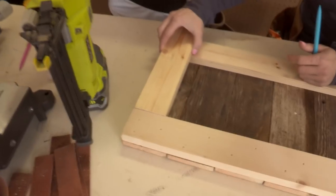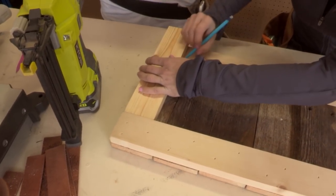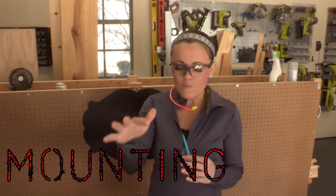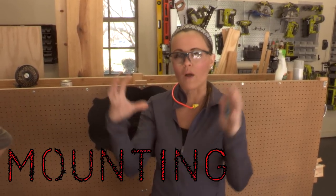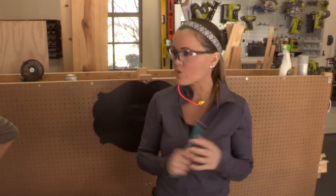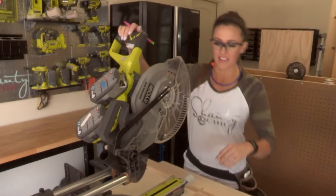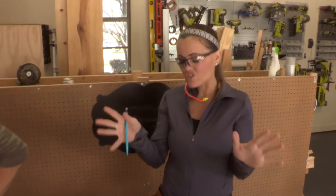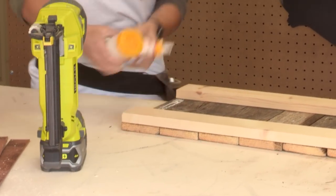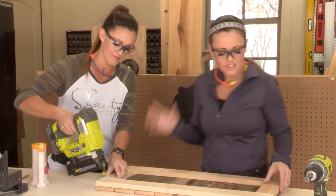We're going to add two more boards — our top and bottom boards — and mark where those go. How do you hang something like this on the wall? I chose to go straight through these boards and into the stud on my wall because I knew the wine bottle would then cover up those screws. You can also add metal D-rings to the back of these boards. I just always feel safe with my kids to have something stuck to the wall. Now I'm going to put glue between these two so we can attach those back pieces, flush with the top and bottom.